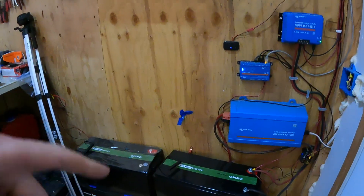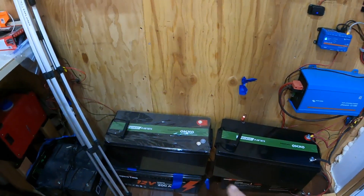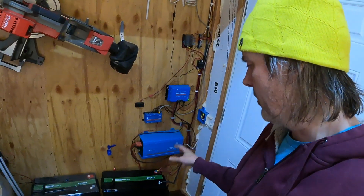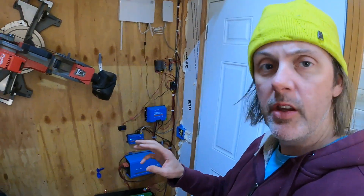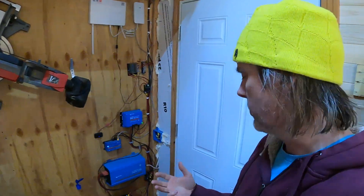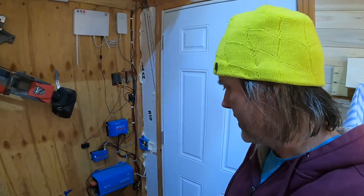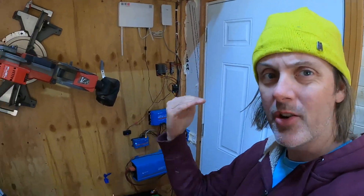It's been a few days — this one is also now charged to 100%. So now what we're going to do is get rid of the old batteries and install the two new batteries in parallel. We're not doubling the voltage, it's still a 12-volt system, but they are both at 100% and should stay pretty well synchronized since we're starting them off at the same charge level.